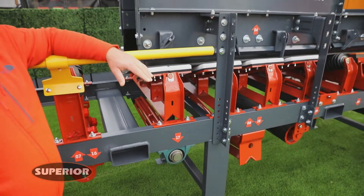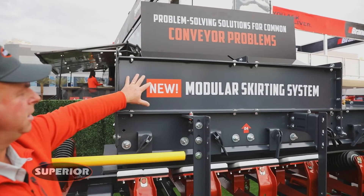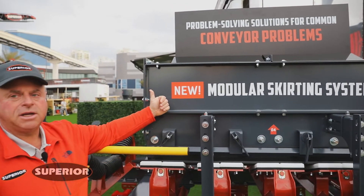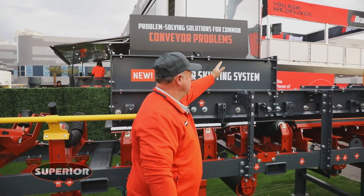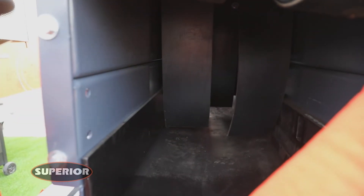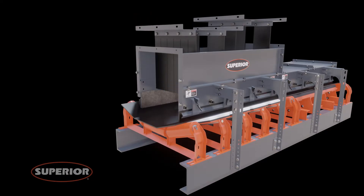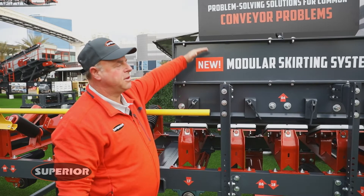Getting to the dust control portion of the box, we have the increased height on the discharge end to minimize the air velocity coming out and carrying entrained dust. Inside this box is a series of curtains that will help settle the dust back onto the belt and contain everything. Different air velocities require different heights of skirting, but the vast majority of applications can be handled simply by doubling the height of the skirt board.